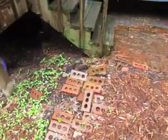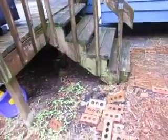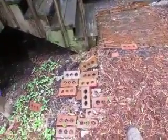I feel him bending one of them. These stringers could use a middle brace, and that's why they're bowing like that. Randy, what you could do, take the five spindles off, bring a 2x12, but that one looks pre-cut for 4, but you just can't know, and it's got to marry up exactly.